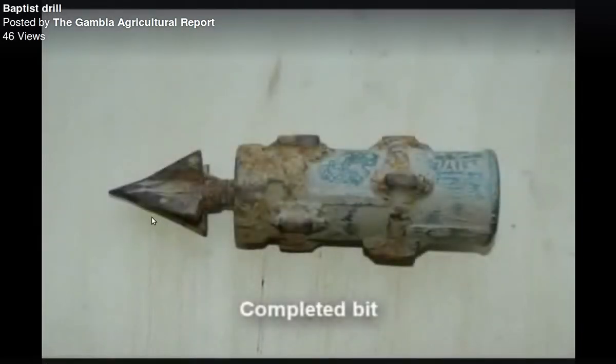There's your hardened steel tip, and the bolt runs through here and stops probably right here — that's where your check mechanism is. Liquid comes up and in but can't go back out because of the check valve. Here are the little pieces of steel, and those are to keep it from sticking in the mud. The tip gets pounded into the mud and can get stuck due to suction, so these pieces break up that suction.